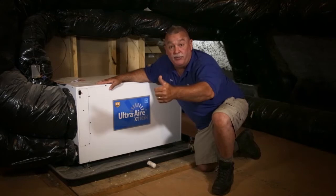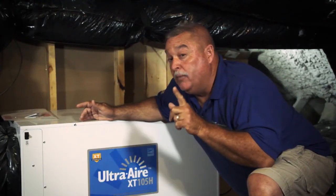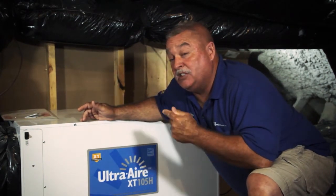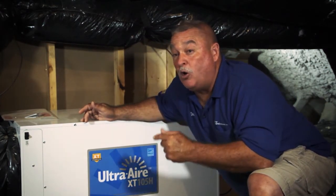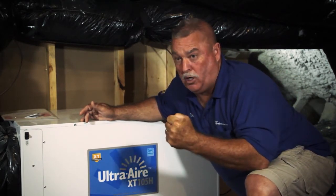The big boy gets to take a break and rest. I would put big money on it that this homeowner would have their thermostat set at 78 degrees. The humidity level in this house we can set at 40 to 45 percent — they can walk in here at 78 degrees and feel cold, comfortably cold.